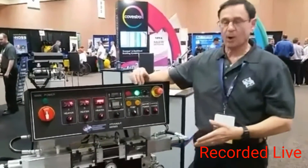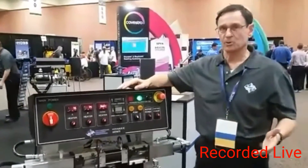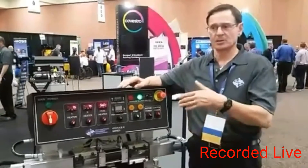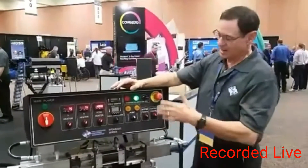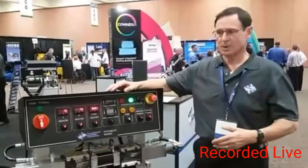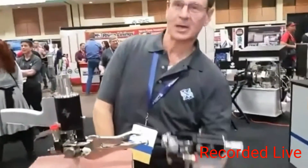This unit can run 410 feet of hose. It comes in both the high pressure version for polyureas, with a maximum operating pressure of 3200 PSI, and a foam lower pressure version at 2000 PSI.